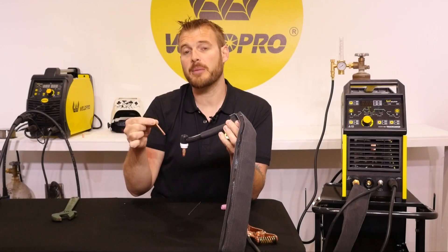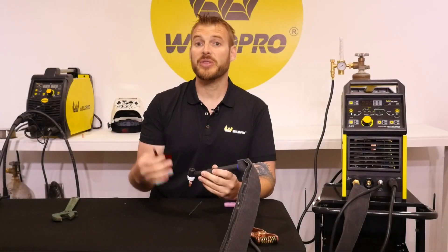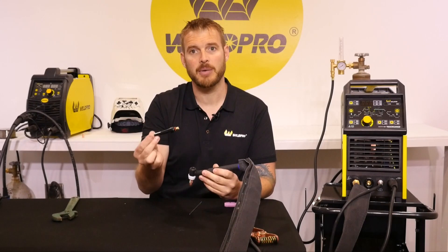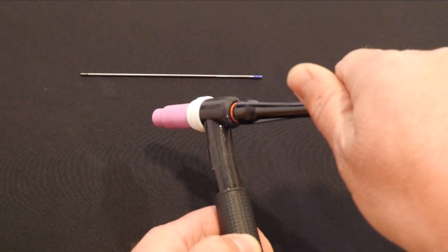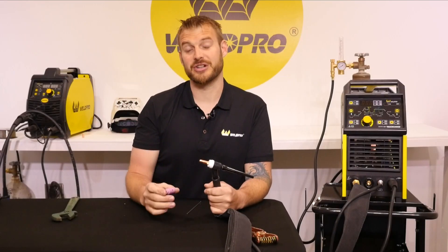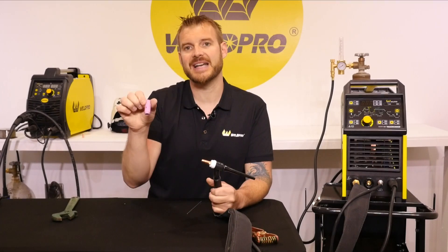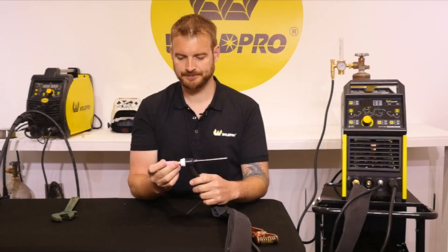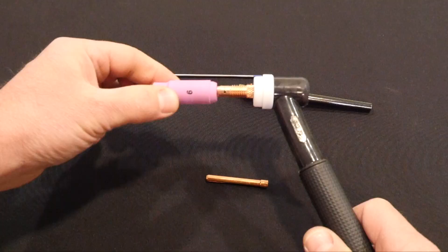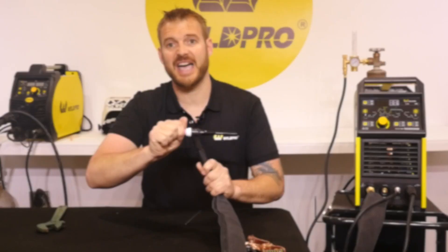The collet will drop in from the back side of the torch and rest in the collet body. With the collet inside of the torch, go ahead and install the back cap or the stem, but don't tighten it just yet. Your TIG 200 came with a few different sized gas cups — go ahead and pick up the size 6, as we're going to be starting with this one. Thread the gas cup over the collet body on the insulated end of the torch and thread it down until it's tight.